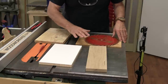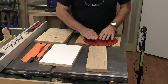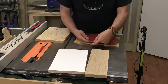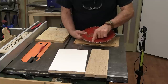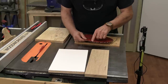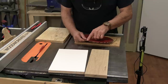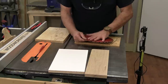A little housekeeping since we have so many new viewers. First: whenever you're changing blades, never, ever lay your saw blade on a steel deck. Carbide is like a crystal — even a slight strike against steel can chip a carbide tooth. Once chipped, you can't see any cracks, and when you spin that blade up to speed an unseen crack can send carbide flying. I've heard of people hit in the face with carbide that actually embeds in the skin. Not something you want to toy with.